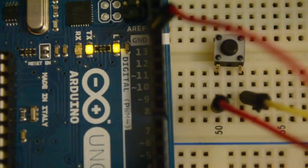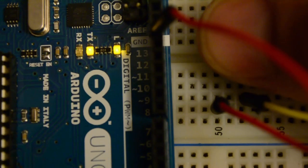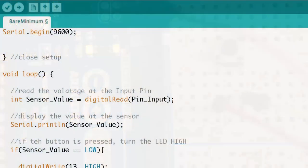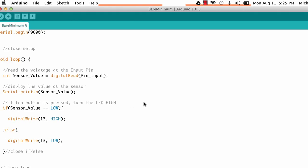I've uploaded it to my board, and as I look at my Arduino the LED at pin 13 is kind of pulsating — rapidly blinking. What's weird is it's on in the first place, even though I'm not touching the button. When I touch the button it stops pulsating and the LED comes on brighter, then I let go and it starts pulsating again. The serial monitor shows the same random ones and zeros — noise is interfering with that pin, giving false positives for my button press.